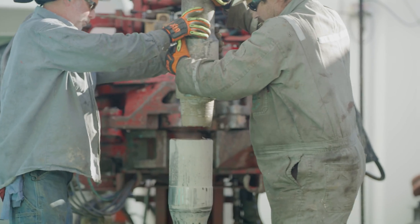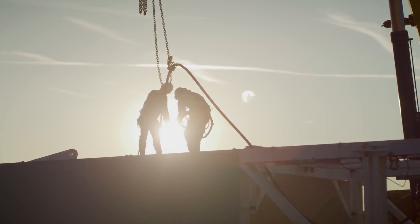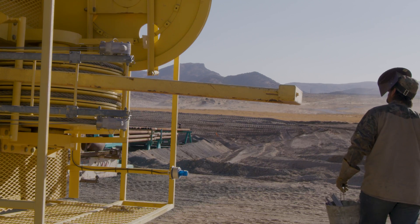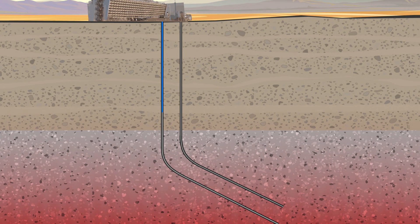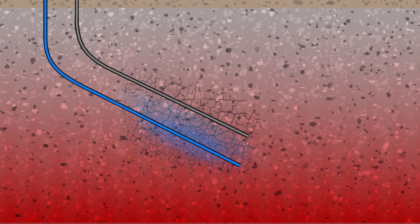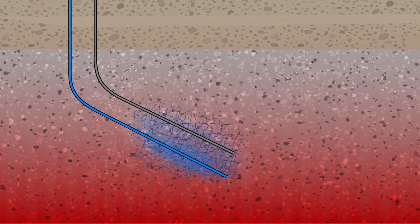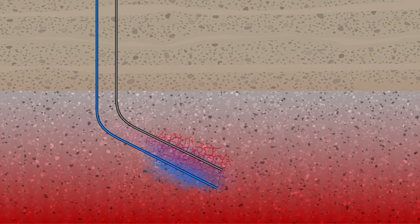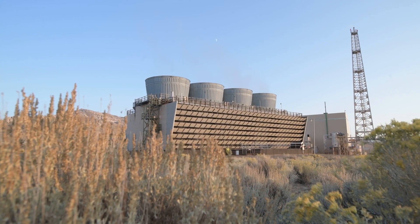This well is the first well of a pair of inclined wells — sometimes called a doublet. These two inclined wells will be interconnected by hydraulic fractures and natural fractures specifically created in this reservoir. You'll pump cold fluid down one well; it will travel through the natural and hydraulic fracture system, pick up thermal energy along the way, reach the second well, and be produced to the surface where the heated fluid can be converted to electricity.